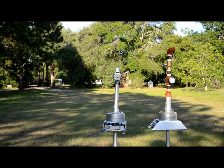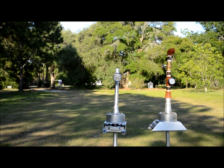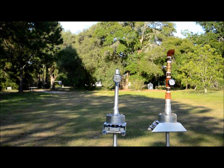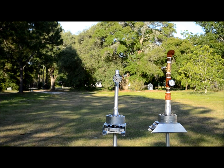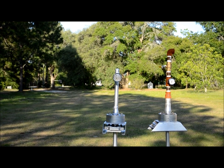Building pressure on the emergency connection device designed to lock onto an oil well pipe such as seen in the BP oil crisis in the Gulf. The unit will lock onto a pair of flanges and create a seal holding the oil in and keeping the seawater out, and is a much faster way of locking onto a well. We'll connect directly to a pipe being lowered down just by bolting it to the existing pipe connections. No special attachments made. It will be flanged to connect directly to the oil well pipe.